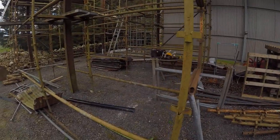I've been stripping the framework, removing the old sheets — that's a few of them. I've been cleaning them with an angle grinder with a twisted wire cup brush in. Horrible job, but someone's got to do it. And getting it shot-blasted — access to this place is a nightmare.